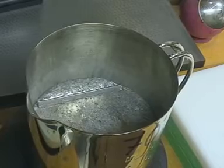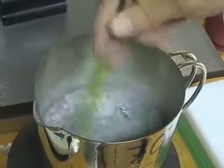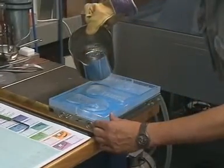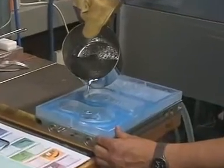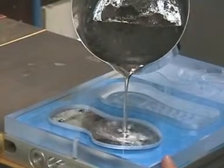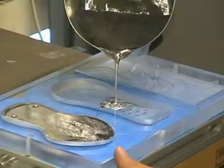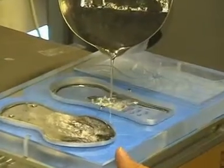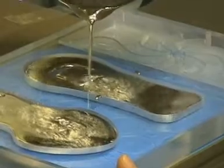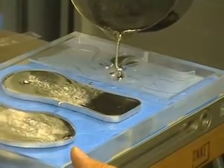Melting down the LM70 alloy at 70 degrees Celsius. Pouring should take place when the workpiece is clamped onto a vacuum chuck in order to avoid distortion of the material. Pouring the melted alloy into the first side, making sure to leave an even top surface which can then be vacuum clamped with a VAC mat for machining the second side.